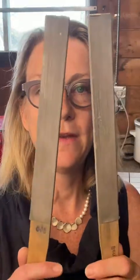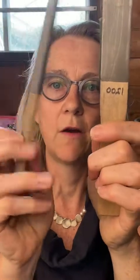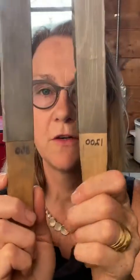Each length of 1-footer, to shape the initial wire, is forged, and then it has marks in it, so it needs to be cleaned up, and that cleaning happens with sandpaper. These are sandpaper sticks. They're actually painting sticks. They're marked with their grit, so 800 and 1200 here.